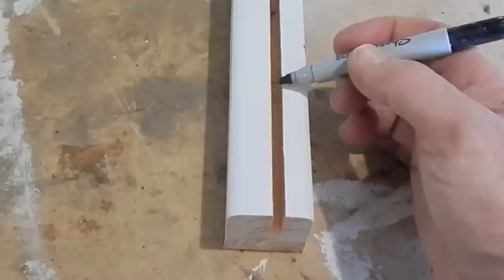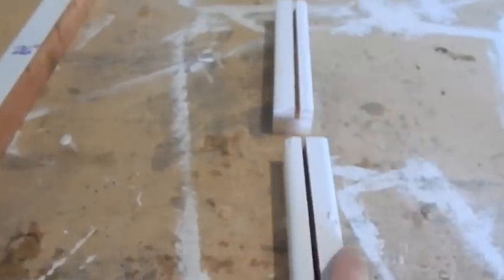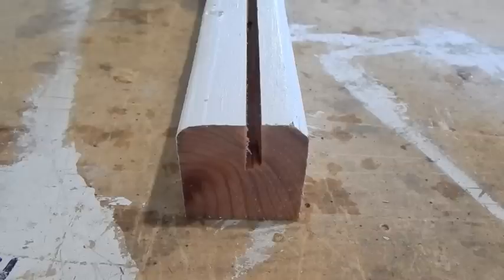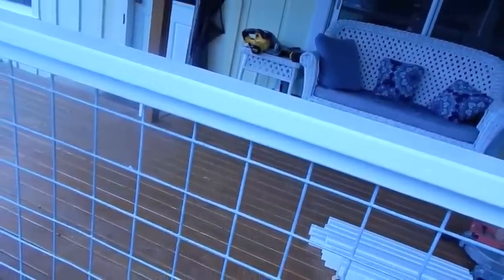So you start your cut right in the center and move it to one side. When you make your cut, you flip your boards over — there's your offset. To get a wide enough groove to accept the hog wire, I had to put two blades together on my table saw, and I ran that at a 5/8-inch depth down the boards. On my handrails, I made sure I grabbed the best boards of the bunch and gave them three good coats.